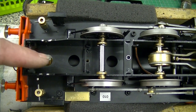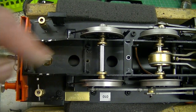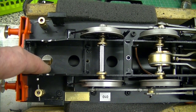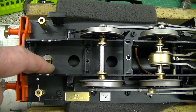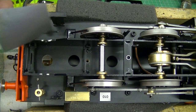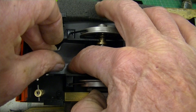We should be mounting the radio control batteries and equipment in this space underneath the cab — it's nice and cool away from the heat. But it has these holes, presumably for letting water out of the cab drip down onto the track. We don't want oil and water dripping onto our radio control equipment, so we use some small pieces of duct tape to seal off these holes.